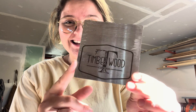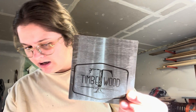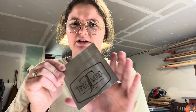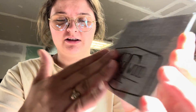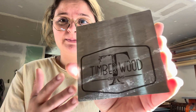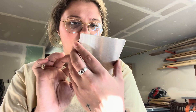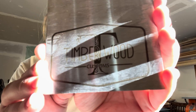The aluminum engraving just finished and it's not really that hot — I expected it to be. This is on straight aluminum with no spray or anything special. Actually, I think these were the stainless steel settings — it's a little heavier than aluminum, which is still crazy to me that I can engrave that on a diode laser. It's pretty clean, you can't feel it and you can't wipe it away. I'm really surprised at how well this worked.